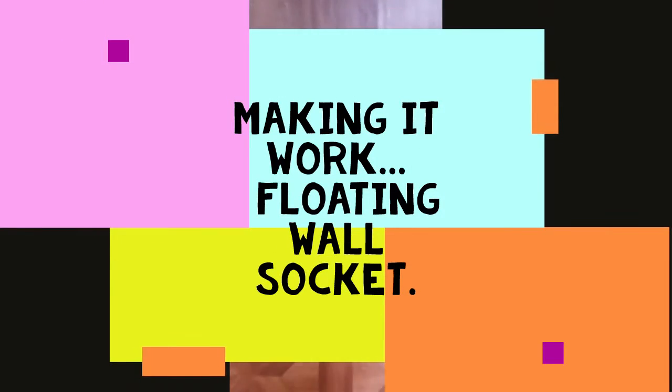Alright, remember when I said that the way it was going to stick was not going to work? Well, that's absolutely what happened. I just have to get on this end, 2 longer screws to go in here. These 3 are working. So if you buy a product and it's a new thing on the market for people to try and it just doesn't work for your specific needs on this floor, what I did was I drilled 5 holes and had some long enough screws for these last three. I have to take those out and put longer screws so it'll catch in the floor. This way, it's not gonna come up and it's a nice transition from here to there. It's kind of smooth.